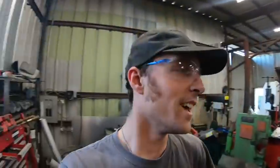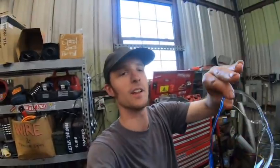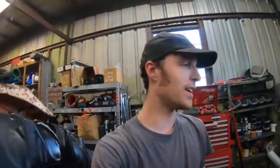Okay, so what I've learned today is, one, it's really important that we don't tighten down the nut on the inner tube before we do whatever comes after that part. I don't even remember, it's been a long day. And two, the main thing I learned is when it comes to peeling off the inside of the tire, the only thing I would have done differently on this project is to have driven this outside. So like I said, I could just put the front end loader bucket on it and just peel it right off the rim. That would have made life easy.